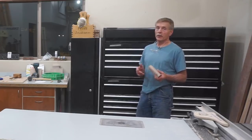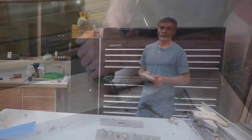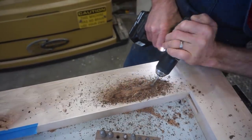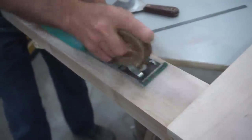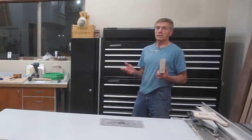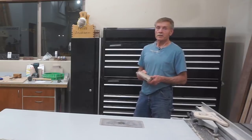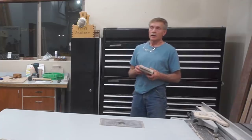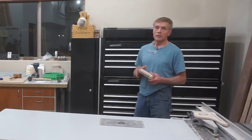The process I'm going to show for repairing these defects is basically the way I learned to do body work back in the late 1970s — it's all the same stuff. Proper preparation, proper application, and then a sequence of sanding steps will yield perfect results when painted over. Of course, this is no good for stained material because there's no grain in the Bondo, but for paint grade, there's no grain necessary.